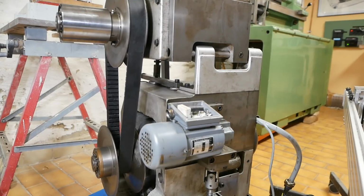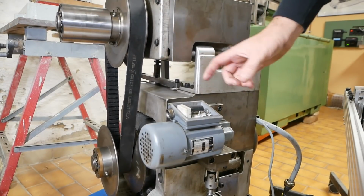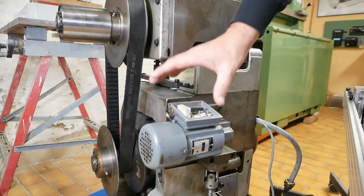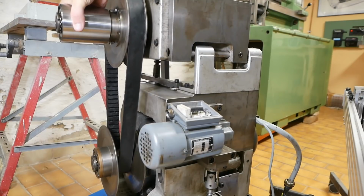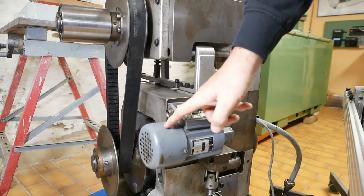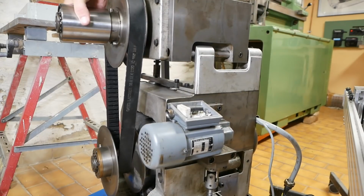I can just go ahead, install this whole unit, keep the belt, keep the variator. I've got all of the control components for the variator, and I'll be able to integrate that into LinuxCNC. The question is how I do the spindle speed control with VFD plus variator plus back gear, but that's just a software problem, which I probably can't solve at all.